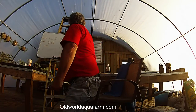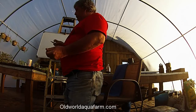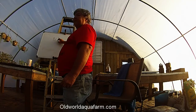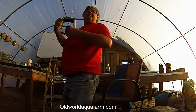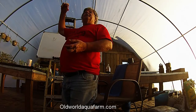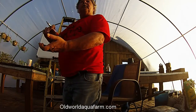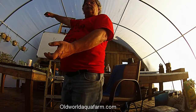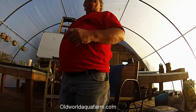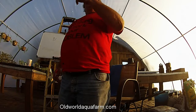Pumps are really simple. For every 1 foot in height, your pump loses a percentage of its pumping power. You'll see on the box where you bought the pump, you'll see head pressures and things like that. So that's every foot in height from the bottom of your pump to the top of your system, wherever that is, it's losing head pressure. So a 1,320 gallon per hour pump like on those 2 tanks there is probably only pumping about 900, simply because of the head pressure.